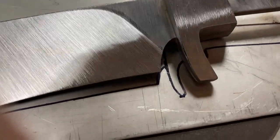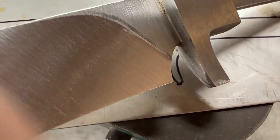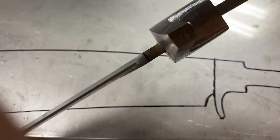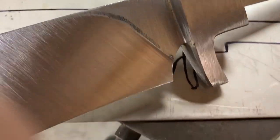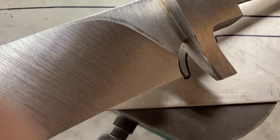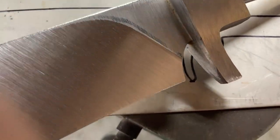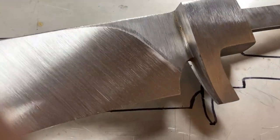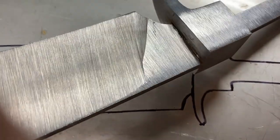So you can see how in a very controlled fashion, what I could see while I was grinding is what I was seeing. And I was able to get a full depth — nearly full depth — smooth, pleasant curve, dang close to where I drew it. I could have gotten it exactly up to where I drew it, but we're still pre-heat treat. I'm going to save that little finish grinding for after we get this thing hardened and all ugly again with some scale and stuff. And now I'm just going to do this same thing on the other side, off camera. We'll have a look at the results after I get done with that.